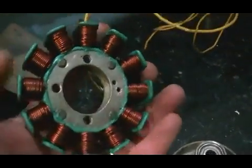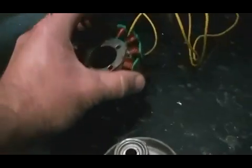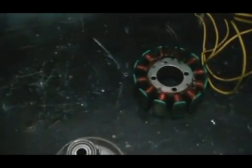So that's where we're at at the moment, that's what we've got to do. Somewhere on my magnet board I'm sure I can find 12 magnets the same to rescue and stick in the rotor. It's probably a little bigger than what John is using, but I think it'll do the job just fine and of course it fits in here just nicely with enough room either side for our small magnets. So our next task is to machine this up, rip that steel hub off, drill those blind rivets out, and then machine our shaft carrier and bolt it up to the flywheel. We'll go ahead and get stuck into that and as usual I will keep you updated with an update video. Cheers guys.